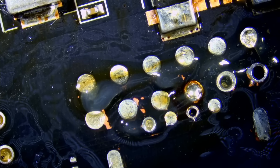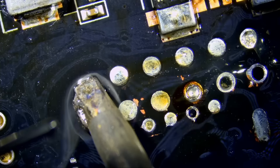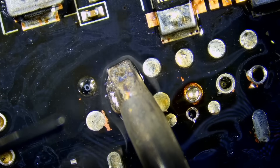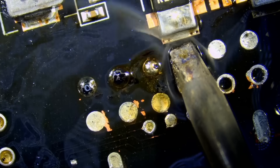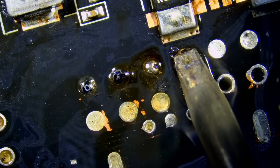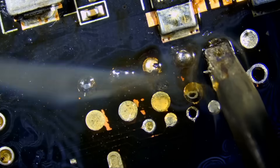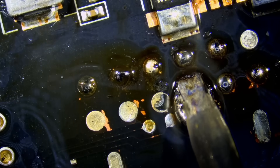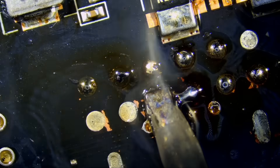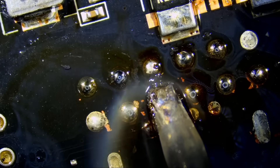As mentioned in part one, without low-melt solder this would have been very difficult. What I'm doing now is mixing low-melt solder with the leaded solder on the board. When the soldering iron hits the board, the solder will liquefy through direct contact, and the low-melt will mix with the leaded solder to lower the melting temperature. We have to make sure we leave the soldering iron with the low-melt on the board for more than a few seconds so it can properly mix — just tapping it briefly does nothing.